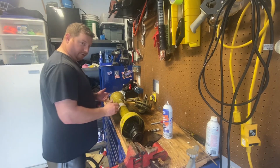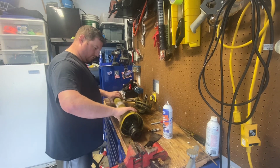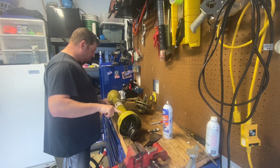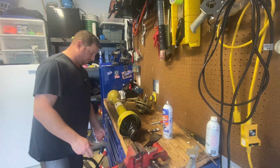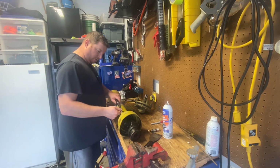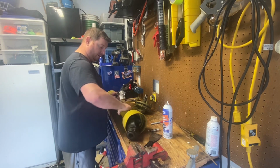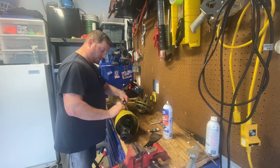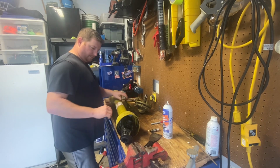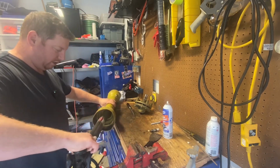All right, a couple different angles here. One from my side, one from above. First thing we've got to do is remove the shields. So we find out which one's the inside, which one's the outside. Here's the outside. These are just screws that work kind of like cams. So we'll loosen those up, turn them into the unlocked position. You'll feel it get a little loose, and then just give it a whack, and now the shaft will come right out.